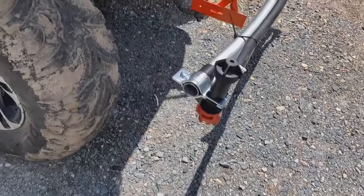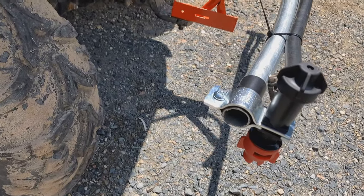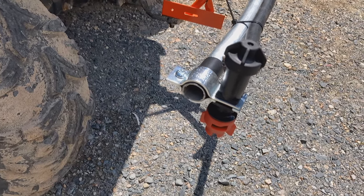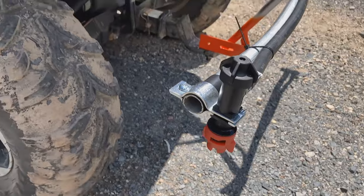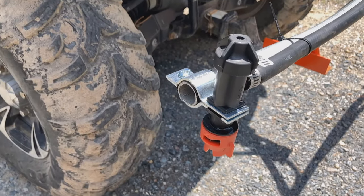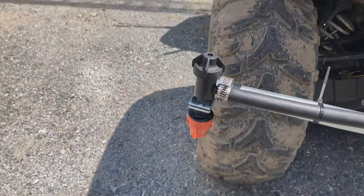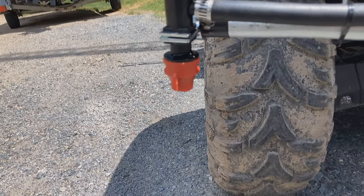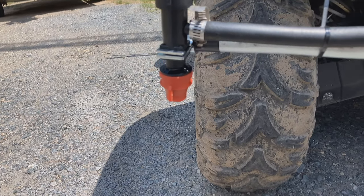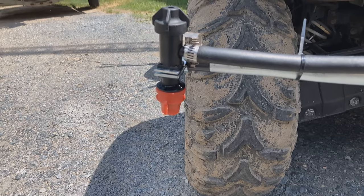The sprayer nozzles are a brand called TeeJet, and you can buy these cool clamps separately, they don't come with it. They clamp on either 3/4 or 1/2 inch conduit, and then it holds the nozzle body. And in this nozzle body, they have check valves in them so that if you turn the sprayer off, they don't leak out. And then these spray nozzles are removable. So I ordered two different sets, and there's numerous different kinds you can get for different applications.